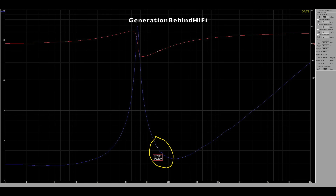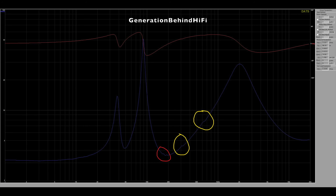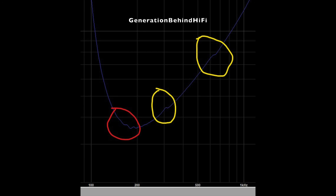Now let's see if the measurements I take from my Dayton Audio DATS V3 line up with their measurements. The first graph I'm showing you is the impedance sweep from my KEF Q350 driver in free air. The Q350 woofer does have some driver resonances between 140 Hz and 200 Hz — there is nothing I can do about those, but we'll need to take them into account when measuring the driver inside the cabinet. Here's the impedance sweep from my KEF Q350 speaker. There are some cabinet resonances circled in yellow, which line up with the Stereophile spectral decay plot. The resonances circled in red are caused by the driver, not the cabinet.